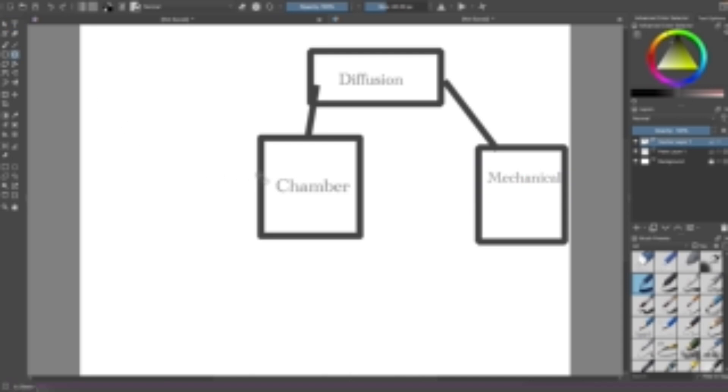Now let's move on to the next step: building your inner grid. The inner grid is going to be inside your chamber, and it's where we attach our high voltage feedthrough. The purpose of this is to confine and shape the plasma generated from the process of ionizing our deuterium gas. This part is very important because it's what keeps the plasma from going all over the place.